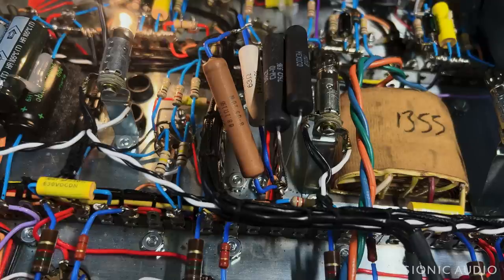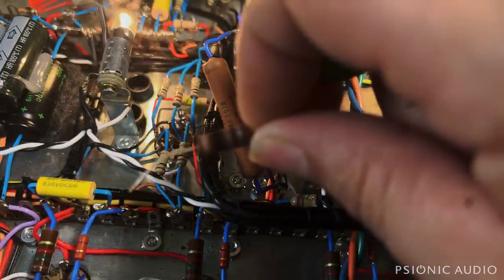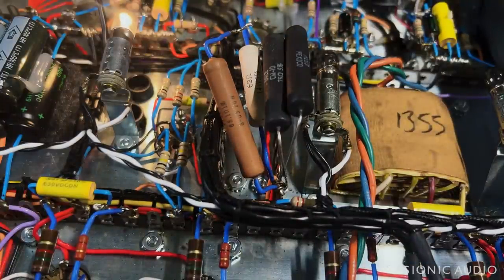So Mark and Phil were doing the same thing, and we're chasing the same end goal that I chase with the Voxes I work on — I'm not at odds with them. If a pro player was using this in a studio and wanted it exactly right, I'd say fine — I'll put those 100-ohm 1-watt carbon comps back. Use it with a Variac or some other regulated supply, and know that you will be changing tubes maybe every six months or sooner. It will be hard on the tubes and hard on the amp. You have to know the choice you're making. The owner of this amp was not in a position to make that choice.